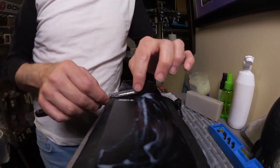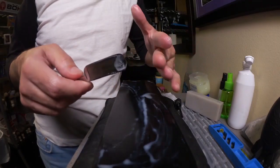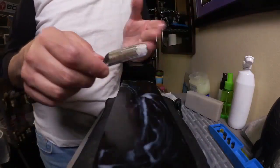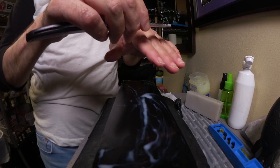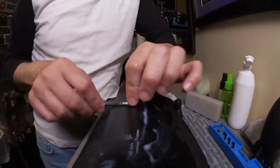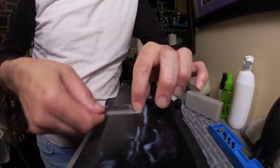They started by holding on the 7-inch wheel for a little while like this to make a whole edge, right? And then they would freehand lift the spine of the razor off of the wheel a little bit to make a secondary, and then they would finish with the spine of the razor more off the wheel. And what that does is that would make an imaginary larger wheel for the front of the apex of the razor. But they did it all by freehand over the course of 3 steps.